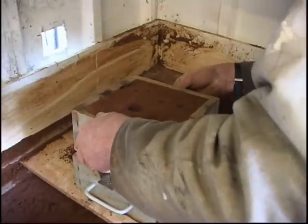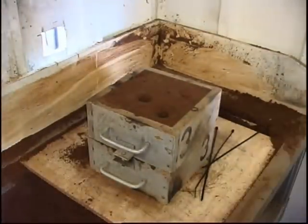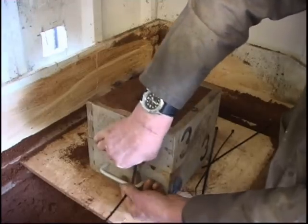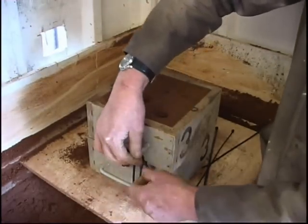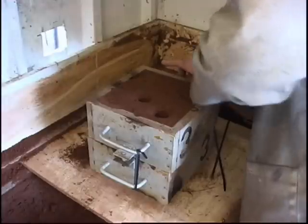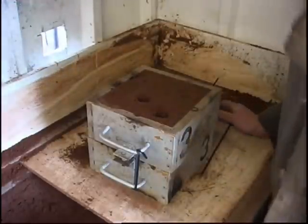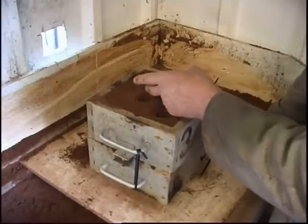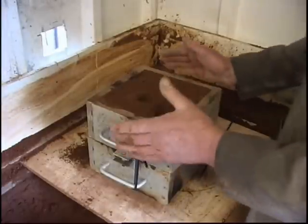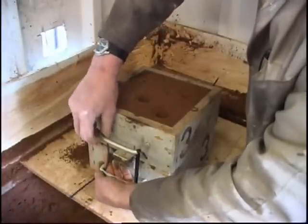Number three in the box — locate and pin, straight down. That's in the flask with cable ties. A bigger flask will put weight on. So metal will be going into that basin — that's your sprue down there — along the passage, it'll fill the cavity where the pattern was. Once it fills up, the metal will rise to the top of the riser. As it cools down you'll see that metal disappear — it shrinks down and feeds the casting. If you don't do that you end up with voids and all kinds of problems.